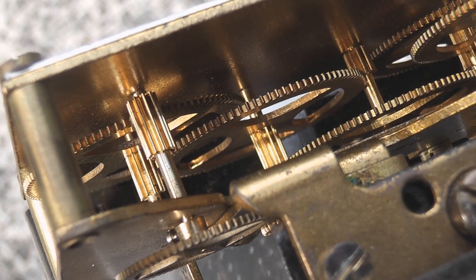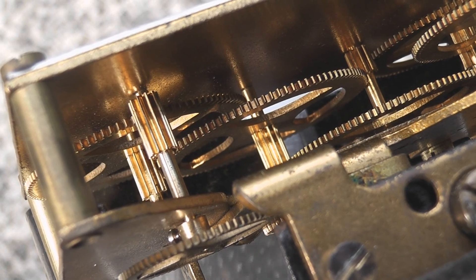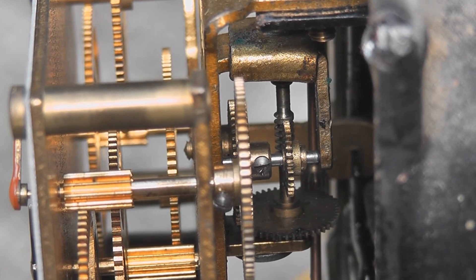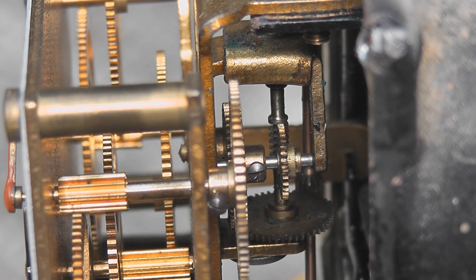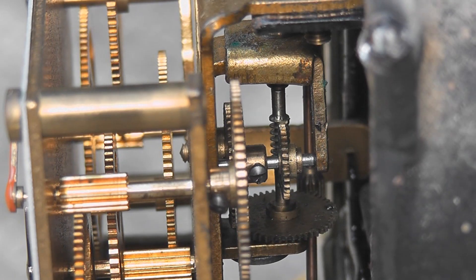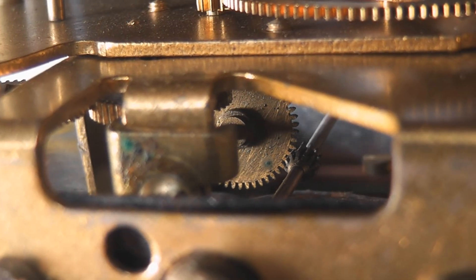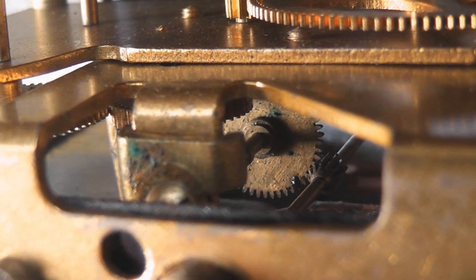You can see the first digit is dark. The top gear is the 100s, then the units, 10 units, 100 units underneath, and the 1000s. Part of the drive train: the disc spindle has a gear drive to a small idle gear. This is a worm drive which goes to a couple of small gears. You can see the actual gear drive from the spindle or disc to the intermediate gear, which has a little worm.